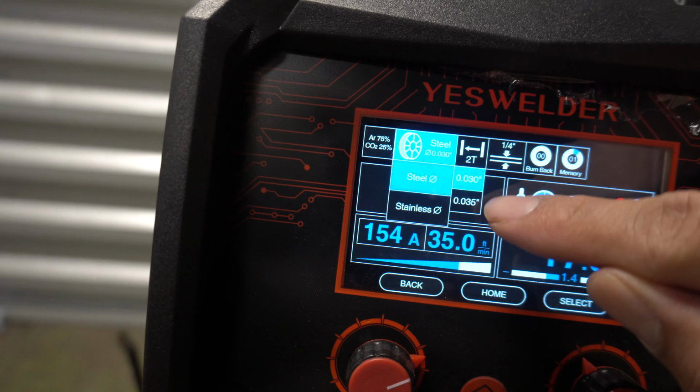Nice, beautiful weld. The temperature of 100 amps for 3/32 is really, really good. That's what you want it to look like, especially when you do vertical. Spread the metal out evenly in both plates. Nice, nice weld. Pretty simple, right?